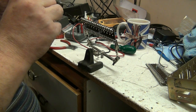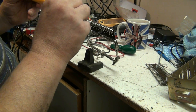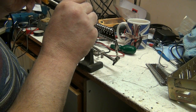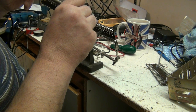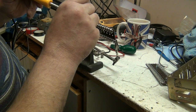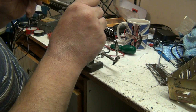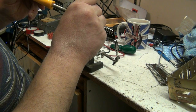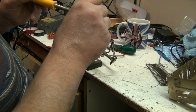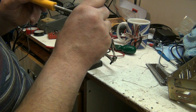So now what I'm going to do, I'm going to solder all these wires in place. I don't want to completely fill up the holes if I can help it, because there's other components going to go into them. Let's just really tack these on, because I'm going to need to not fill the holes up.